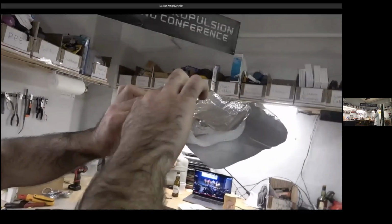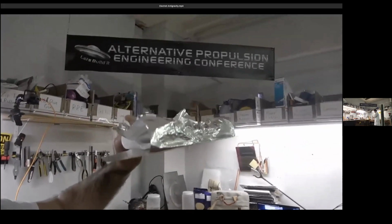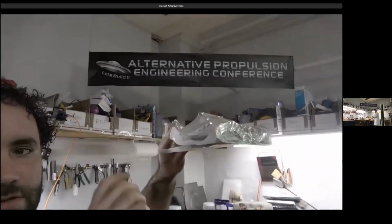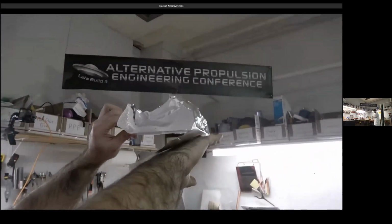The polymers are oriented according to the static field that was applied while it was created, which was around 50,000 volts. In this case, we were at 48.5 kilovolts in order to make this electret.